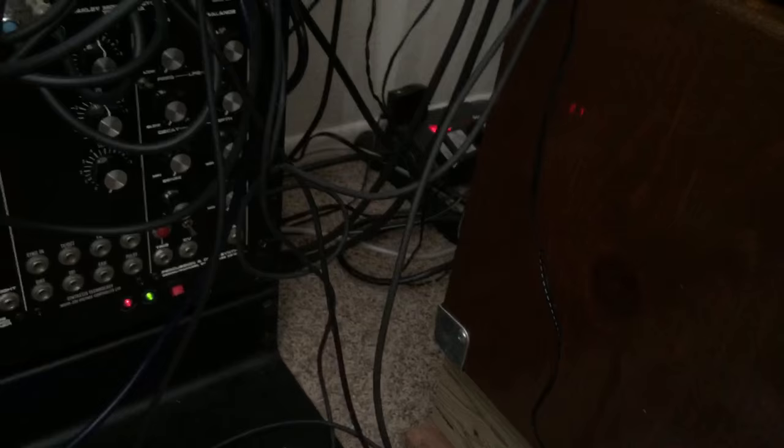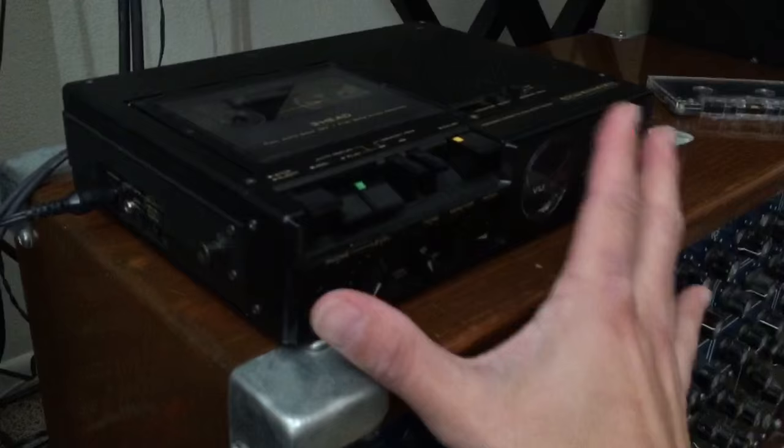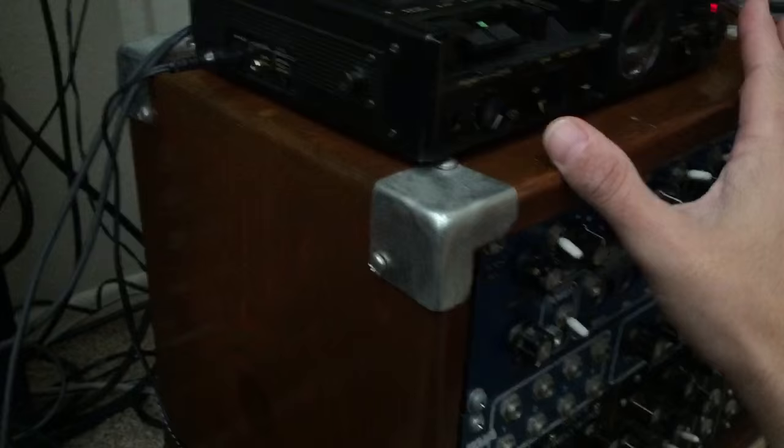So now there's no low end being fed back into the tape echo, and it causes a high pass type of trail — which is something I used to have to use my space echo with a mixer to get. When I make this permanent, I'm going to build a box underneath this that houses a low pass filter, a high pass filter, possibly a tone control, and it's going to need its own power supply because the tone circuitry will be a different voltage than the power adapter.